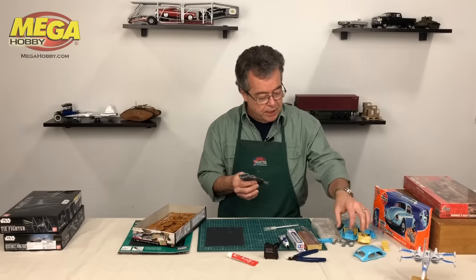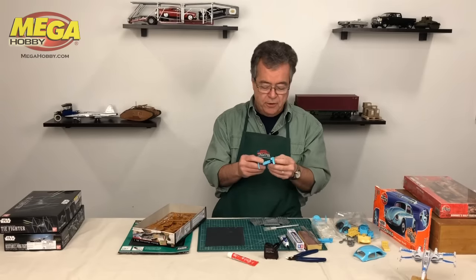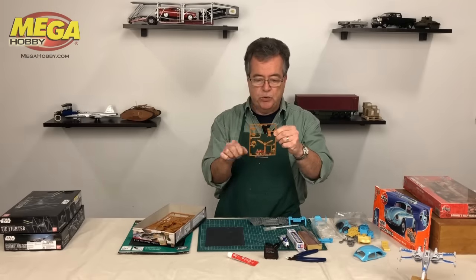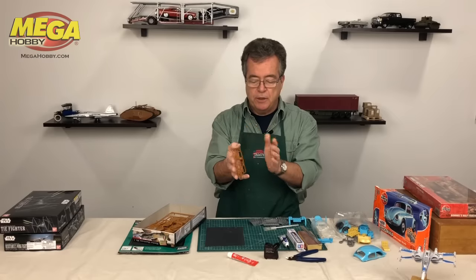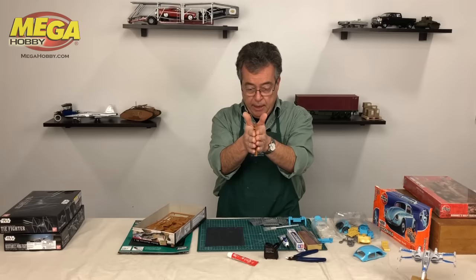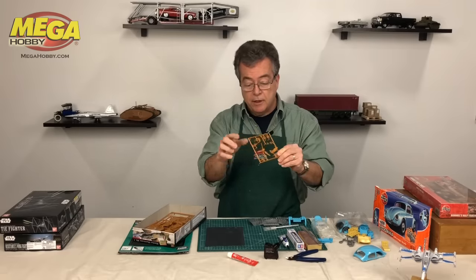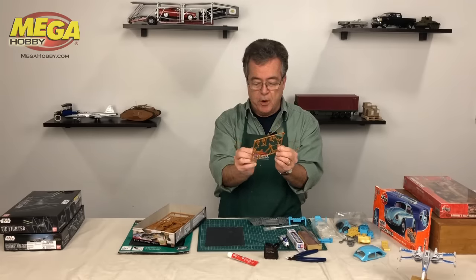So the Airfix kit here, the Quick Build Kit, is really unique in the sense that all the parts are off of the sprue. And you say, well, what's he mean off the sprue? The sprue in a plastic model is the little injection tree that the parts come out on. In other words, when they make a model kit at the factory, there's two pieces of a big steel mold that go together like this, and they inject hot plastic into the mold and then pop it open and pull this piece out. And that's the piece that has all the parts for your model on it. And just as an aside, these molds are made in two pieces, so there's always a seam line, and you'll be able to see where to clean the seam lines off the parts, but I digress.